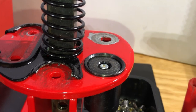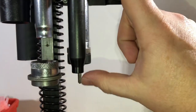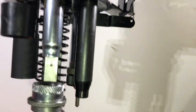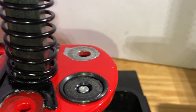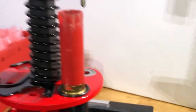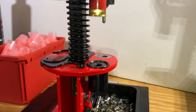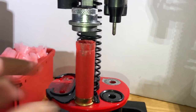Moving over to the priming station: on most manual-operated models, your primer cup is going to be the same as this one. However, the primer push rod here — it basically pushes the hull down on top of the primer to seat it. On standard models, that rod is solid. In the case of this one, it's hollow to allow a primer from the primer feed tray to drop down through it into the primer cup when you do the final crimp. There isn't much adjustment in this step other than making sure everything is tightened down and in place according to the instructions. You just lower the handle and that presses the hull down on top of the primer; it'll bottom out and you can feel that easily in the ram.